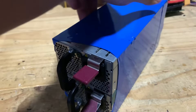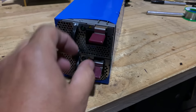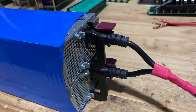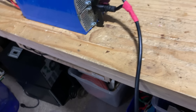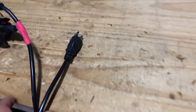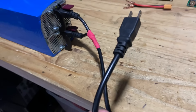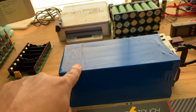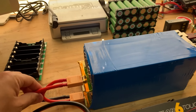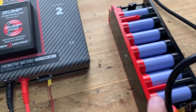After that, I'll use Kapton tape to tape both of these. Kapton tape is high-temperature tape that is usually used for batteries or for isolating circuits that can potentially run hot. I'm going to use it here to isolate the terminals, and I'm also going to use this same tape to tape both units together before we wrap them in this blue shrink tube that is also commonly used to wrap batteries.